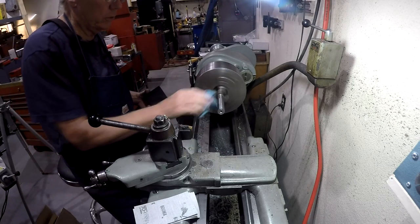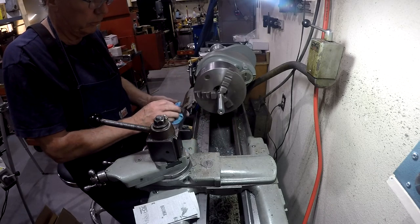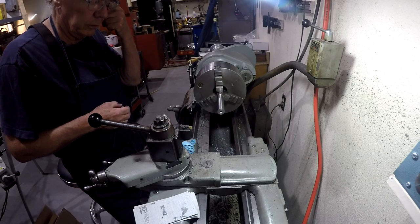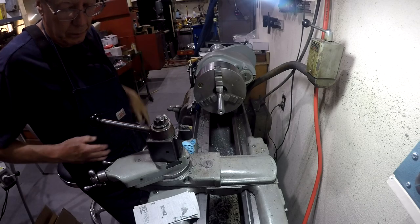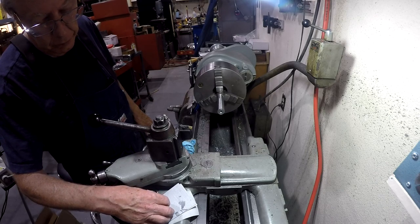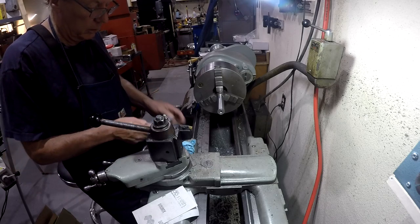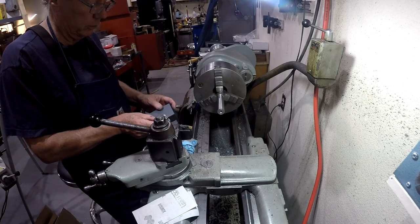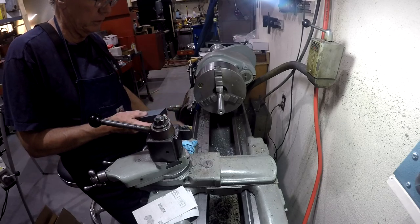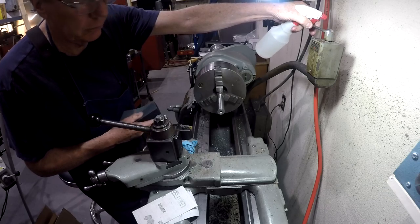That was the 400 MX grit, and we're still to the point where we can still see the sanding marks on it. They're getting finer and finer. We've got three grits left to go, the 600, 800, and 1200, and pretty soon they're going to get about the 600 or 800 level. They stop really being obvious as far as the little tiny scratches from the previous level of sanding.